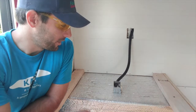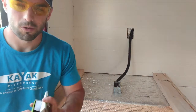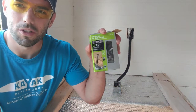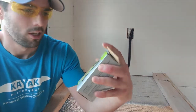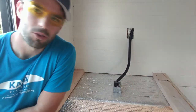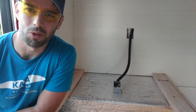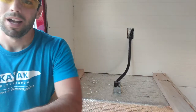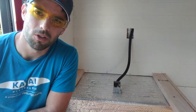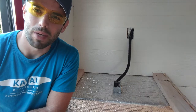So I thought I could run these pieces across, and then just screw them down into the external storage unit, which has about a 1/8 inch aluminum frame. I thought I would just use these 2-inch flathead self-drilling wood-to-metal screws. I thought, 2 inches, that's great. That should be plenty for going through the 2x4, the 1/8 inch aluminum, and a little bit of insulation that's there. After reading the fine print on the box, I realized that in order to get a secure hold, 3 threads of the screw have to make it into the aluminum.